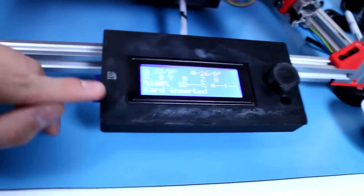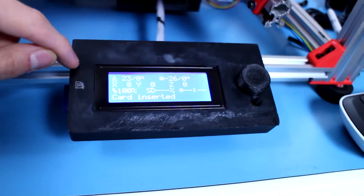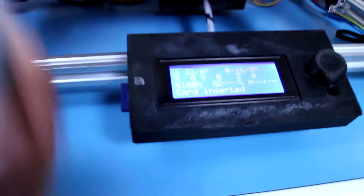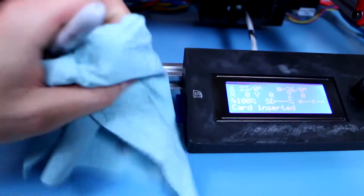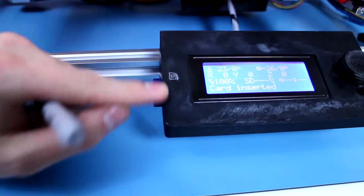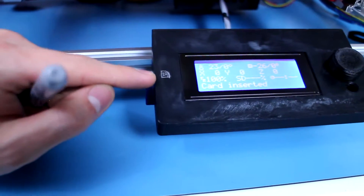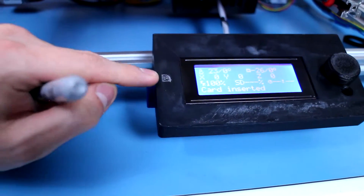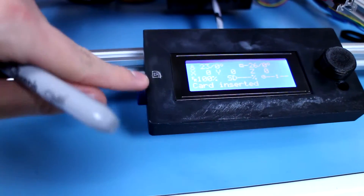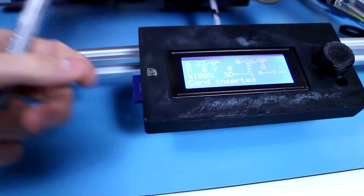The card works properly. I even etched a little orientation guide — I used a scribe to engrave it, then got a silver Sharpie, sharpied it while fresh, wiped it off with a shop towel, and kept doing it until I got a good layer. You wipe off the surface layer around it so you get a nice little indentation. It's a rough drawing of an SD card but it shows me the proper orientation as well as the contact strip.